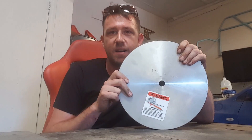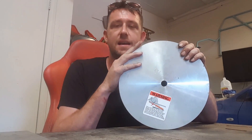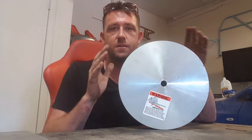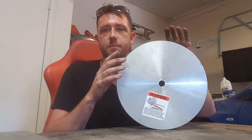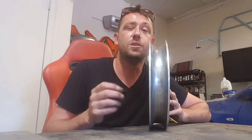The other bender I have is the Rogue Fabrication Model 600 tubing bender. This has just been recently added to my arsenal and I absolutely love this bender — it is a beast. Click on that video card and it'll take you right over there, it's a really amazing bender. This is my inch and three quarter die. One of the reasons why I didn't follow the minimum centerline radius of inch and three quarter times three equals 5.25 is that Rogue Fab does not offer that. The actual profile for an inch and three quarter die is a much larger, very pronounced tube, so having a really tight centerline radius on it looks a little too collapsed. It's actually a good thing that they have a six inch centerline radius die for it, and I actually like that a lot better.